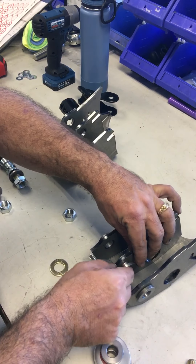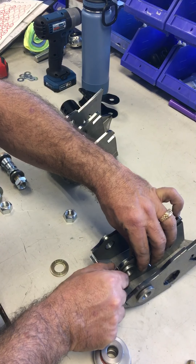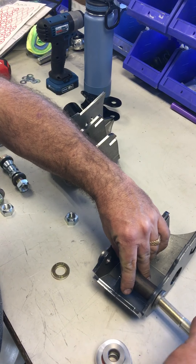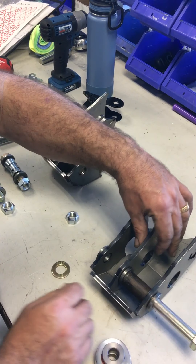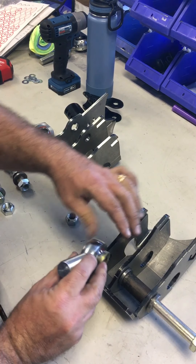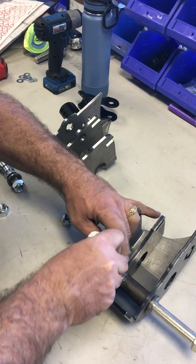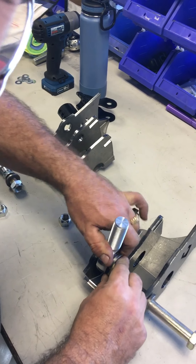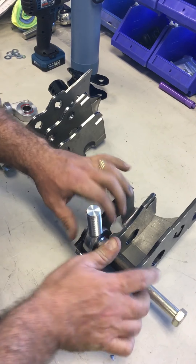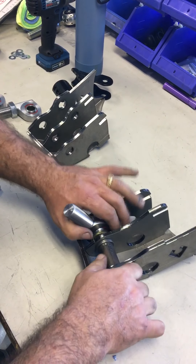We're going to need one spacer here to reduce the hole in the center plate that you've left floating while welding together. We'll take our spacer, apply it, and put our bolt in temporarily to get us set up. The spacing is just slightly larger than these, so we're going to use a washer to offset that, and then we're going to put our heim down in. It'll be a little tight because of welding, so you'll have to push it down in there or push the part into the hole.